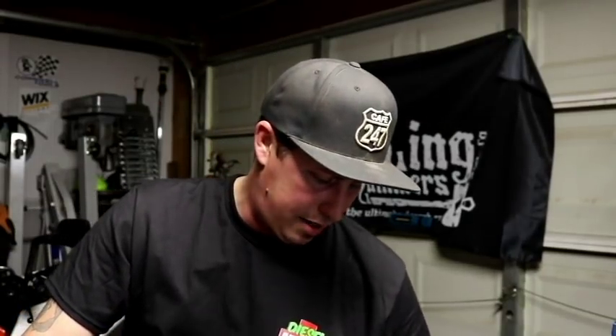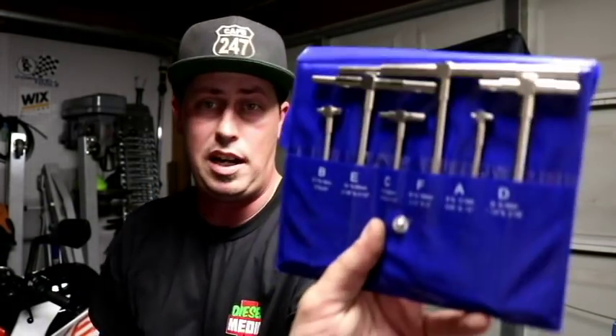There are a lot of other precision measurement tools out there — digital torque wrenches, inside and outside micrometer sets. I've got an inside snap gauge set but not the outside micrometer set yet. If you get into engine building, you'll need to figure out cylinder bore diameter, but one doesn't work without the other: you use the inside snap gauge and then measure it with an outside micrometer to know where you're at. What other machining tools do you guys use frequently? Share them in the comments. Thanks for watching — get yourself a Diesel Medic shirt. Cheers, deuces.